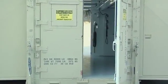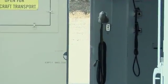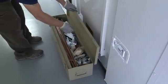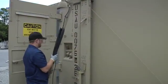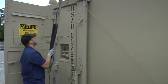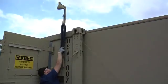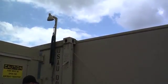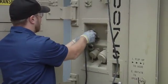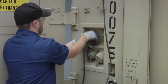Loosen the wing nuts to remove the area light from the stowage location inside of the shelter. A light bulb for this light is located in the equipment container. Install the area light on the exterior personnel end wall side of the shelter by attaching the mounting screws to the brackets provided. Secure the light to the mounting brackets by tightening the two wing nuts. Connect the light cable into J3 or J4 connectors on the power entry panel.